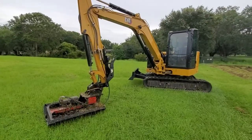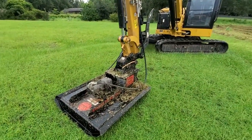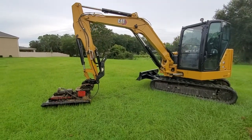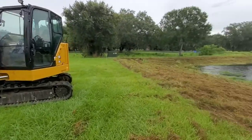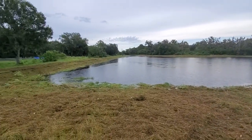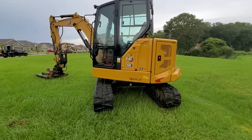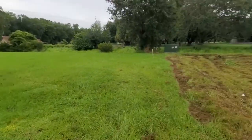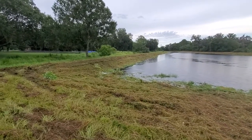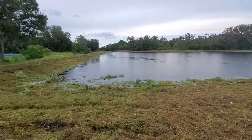Just a quick review of the RUT MFG 42-inch brush cutter — it's designed for grass and some small woody stuff. I just finished this pond; it took me about seven or eight hours. I'm using a Cat 306, with the hydraulic flow set at about 22 gallons per minute. It can go up to 25-26, but the mower attachment is only designed for about 25, so I pulled it down a little to give it some breathing room, and you can see it did pretty well.